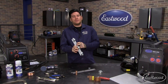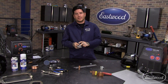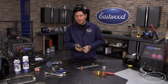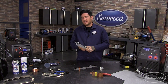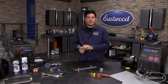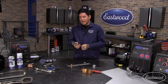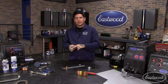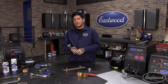The idea with welding with a gap is that again we're talking about 100% penetration. By leaving that gap, you give the wire space to go through and bridge it so you can achieve 100% penetration. It does work and a lot of guys prefer to do repairs this way. The downside is that with this thin sheet metal it can be very difficult to fill across that gap. If your heat isn't quite right, you're probably going to burn a hole through, create a bigger hole, and then have to back-step and fill it in — it can create a mess if things aren't just right.